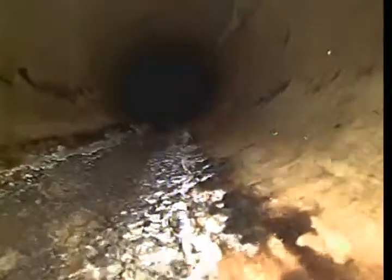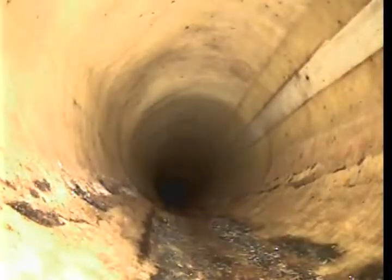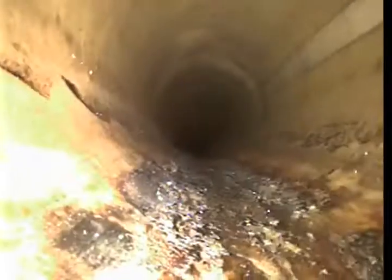We're going in, I believe, what looks to be the 6-inch lateral, which from the look of it appears to have been sleeved, and you see the markings on the side. Especially here you can kind of tell. This may be the 4 to 6 area. It looks like it increases right here. And back further, it looks like part of the 4-inch may have been lined. We'll run through this. We should have about 30 feet before we get to the city sewer.